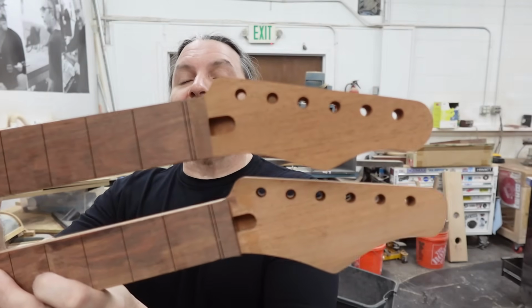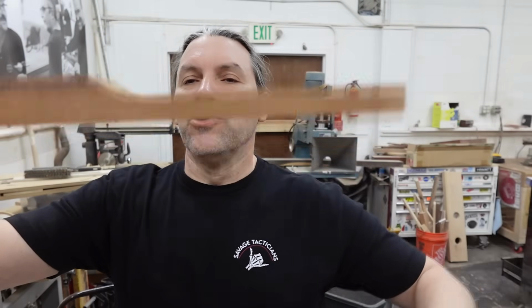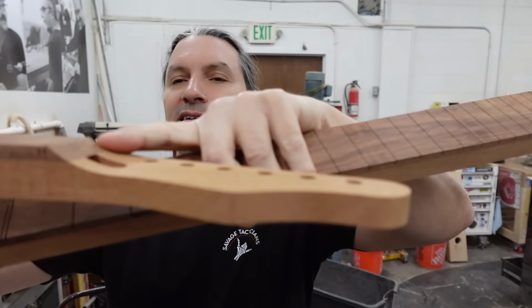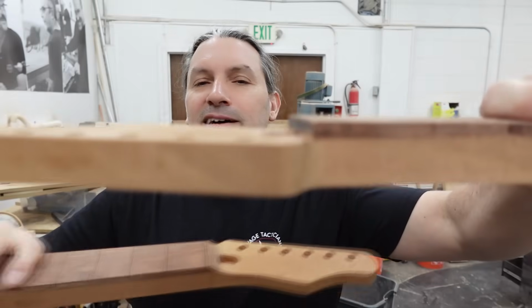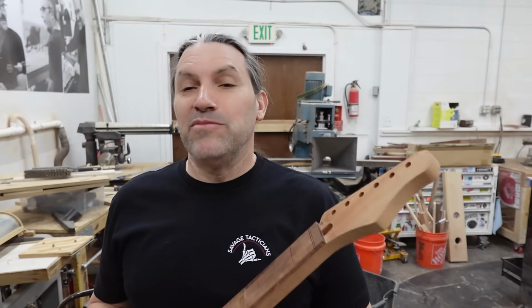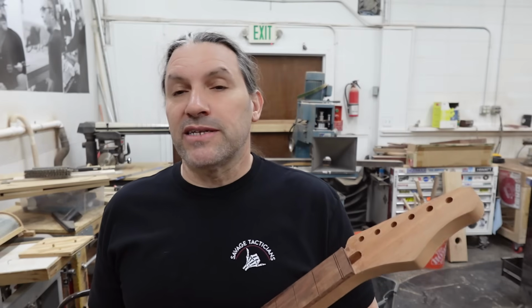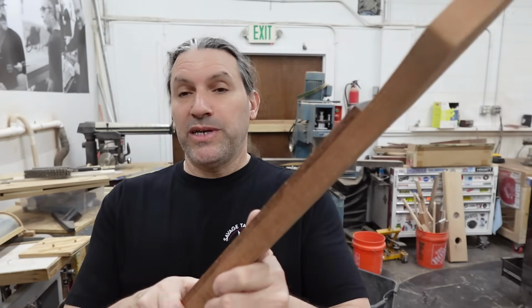So there's one more thing I have to do to get this neck to the same spot as this neck, and that is to put the little scoop out thing right here onto this neck. And any one of you who's been watching my channel for any amount of time knows we're going to go to the Old Man machine, which is a shop-built thickness sander with the sanding drum on the top that allows me to push the piece in and pull it back out again, just like we used at Roberto Venn when I went there in the 80s. And they probably had that machine way before I got there.